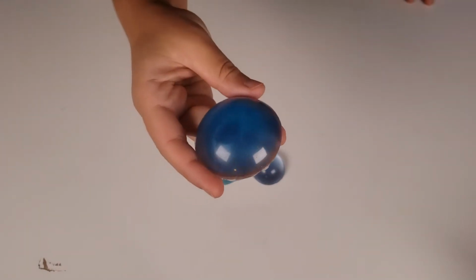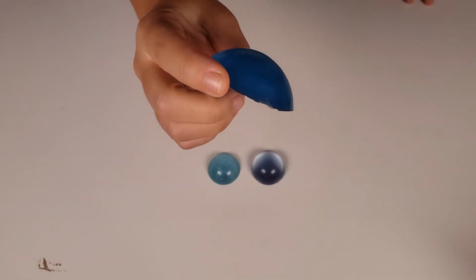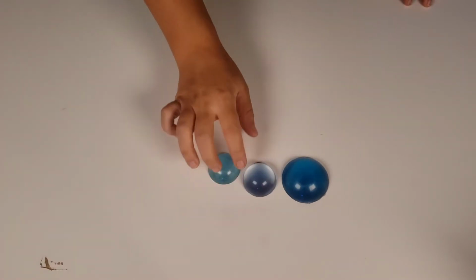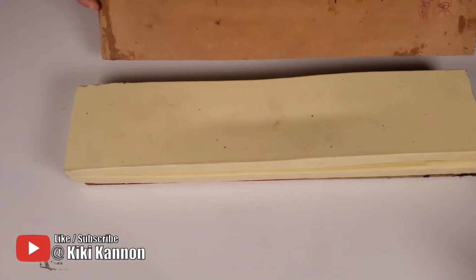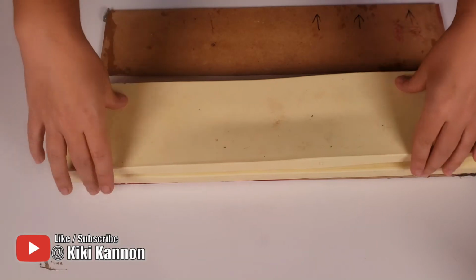As your item gets bigger, it's going to get a little bit more challenging to get these consistent bubbleless results, and then it might be time to look into getting a pressure pot. But you can still get a decent sized item without bubbles, though it does get a lot more tricky depending on what you're doing.